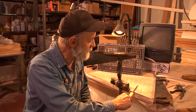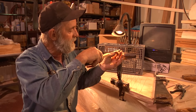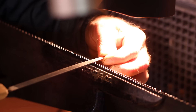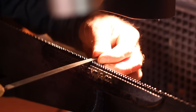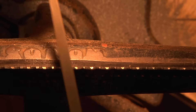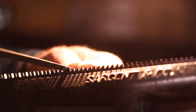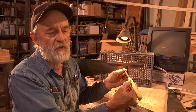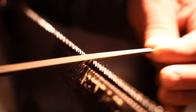I've also got lines on the bench — 10 degrees on each side of 90 degrees across the saw, so 10 degrees this way and 10 degrees this way — and I keep the file level in that respect as I file. When I'm trying to regain even spacing, I really don't have anything to look at except the flat spots on top and the depths of the cuts between the teeth, so it's all done visually. I don't count strokes on each tooth — I just do it by eye, making immediate decisions as I file about which tooth to drop the file into and which direction to file.